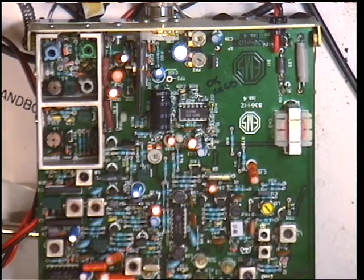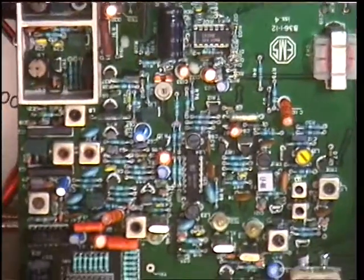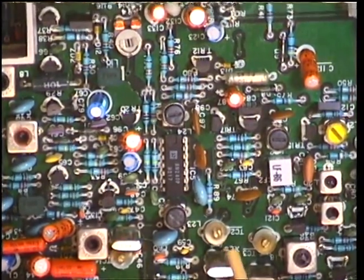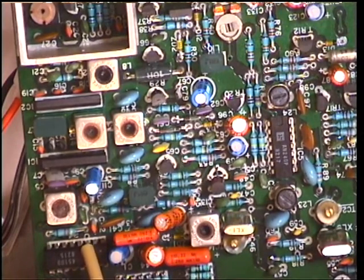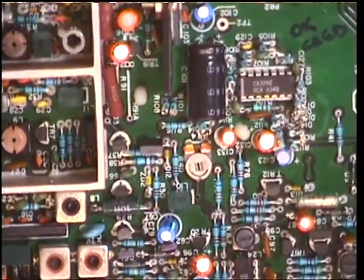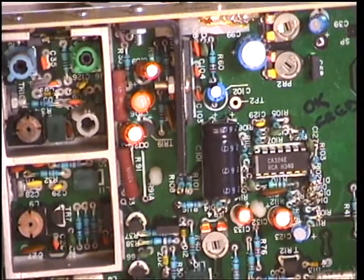I can't really tell you loads of things about this radio, but just to recap: 10.24 is that crystal there — set that by putting the frequency counter on pin 3 and set it to 10.24, then go on channel. So there you have it — the Mercury 1040, which is a UK-built radio, with its unique EMS board. I'll join you on the receive side of this video.